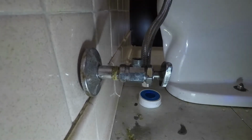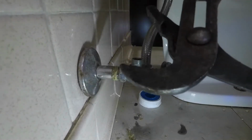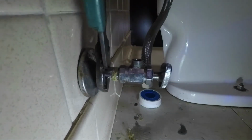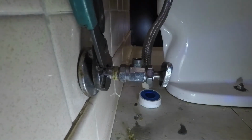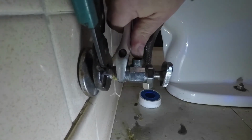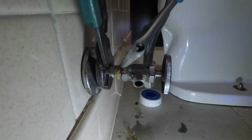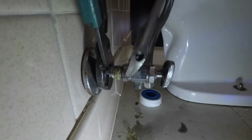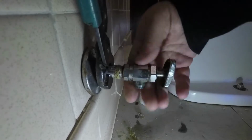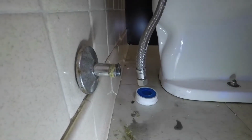Next, I'm going to loosen up the valve. I'm going to put my channel locks directly on the 1/2 inch chrome plated brass pipe. I'm not concerned about the chrome plating on the pipe. I am concerned about making sure that pipe doesn't move, so we don't create a leak inside the wall where we can't see it and have to return to fix that. So I'm not concerned about the chrome plating.